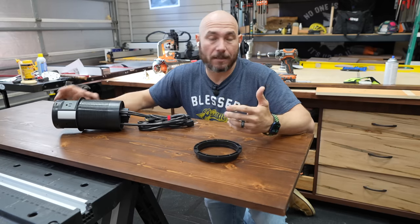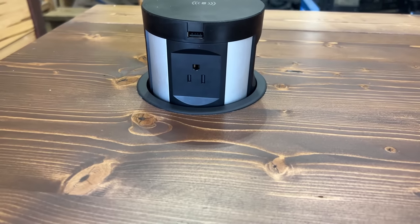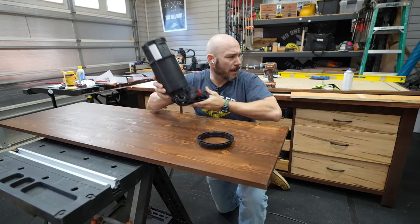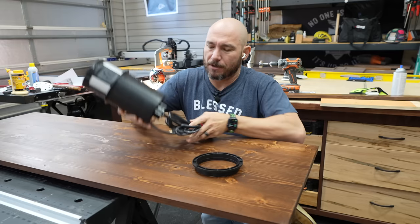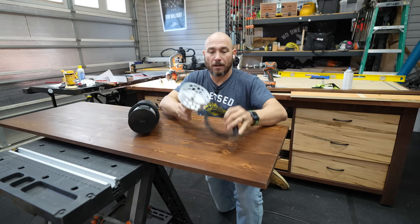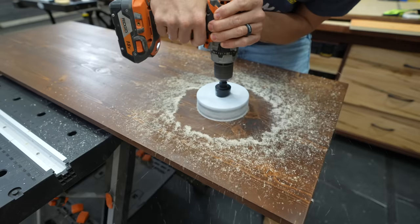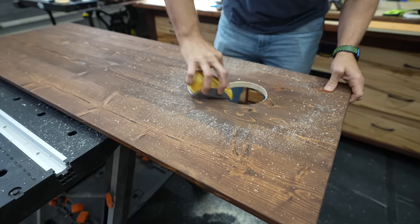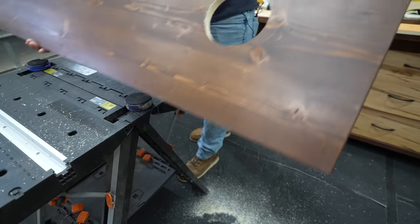One of the cool features we're adding to this desk is a wireless charger for his phone on the top — and you can see it has outlets all the way around it, plus HDMI, data, and USB. All the wires will connect underneath. The only thing I don't care for is how far it's going to stick down, but we're going to hide those wires so you really don't see anything but the base. So we need to drill this hole — I have a giant hole saw that fits this diameter and it'll slide right in. I drill halfway through, just until it starts poking through the other side, then finish the hole from the other side. That keeps anything from splintering and breaking out on you. Use 120-grit sandpaper to smooth over those edges, then do a test fit.